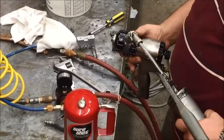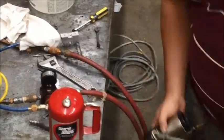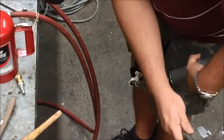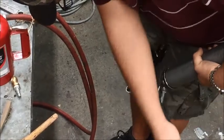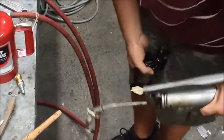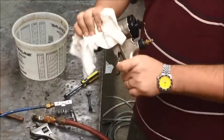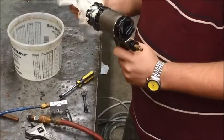On fusion guns you have the ability to do both sides independently, but on the AP2 version of the gun block you can only do both sides at the same time. As long as you're flushing every day, that shouldn't be a problem — it shouldn't clog up. Then wipe away excess grease and replace the little cap on the fluid head.